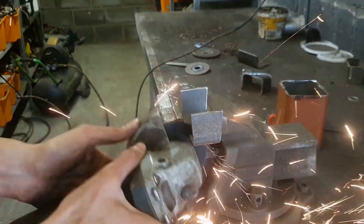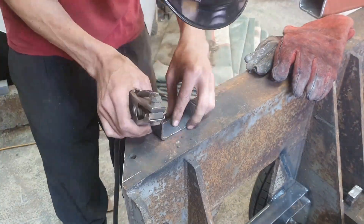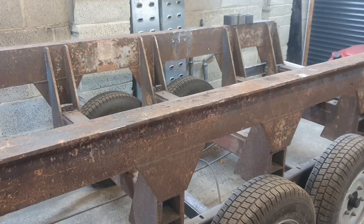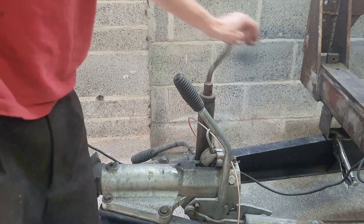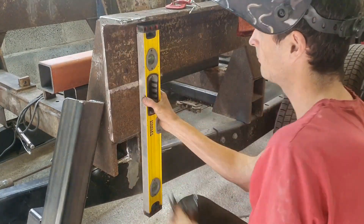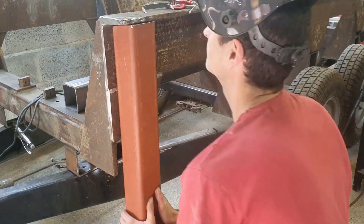Now these are 90 by 90 as well but I'm going to chop them down a little bit. Just chop a little section out like that and weld them back together. So that fits inside the 90 by 90 — you can push the leg onto the bottom of the rolling road from below and that will slot inside the leg, locating it left-right and fore-aft at the top edge. So now I'm just going to get the rolling road level again so I can use the spirit level to get the legs vertical — using gravity rather than a straight edge. Now I know where to put those little pieces on.